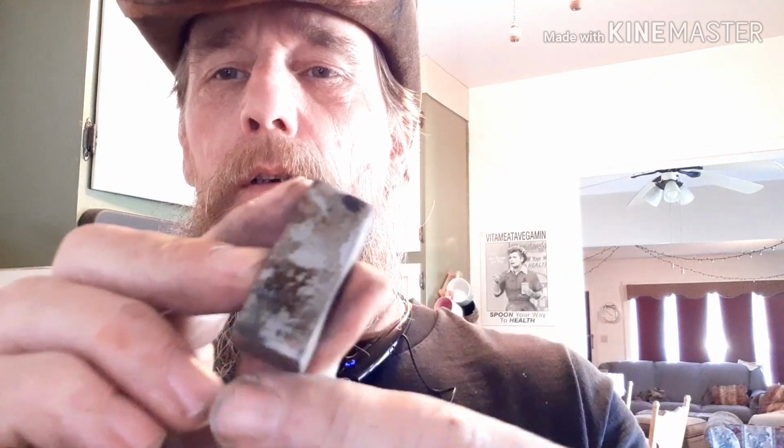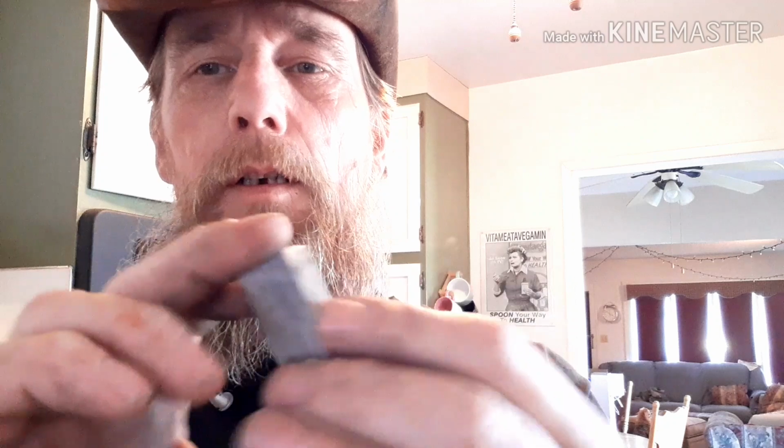Well, I already answered my own question. Started looking at those pieces of Damascus. Got a little curious. Went out back, tapped them with a hammer. Let me see on this one. There's a little seam right along here that was holding it. Spot right down here. Split it right in half. Just a couple light taps. Tink, tink, tink, pop.